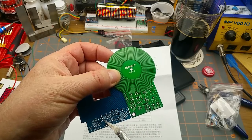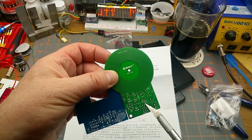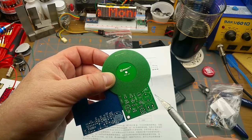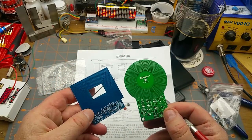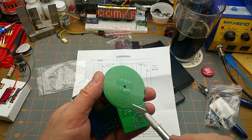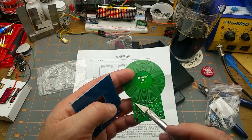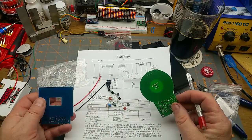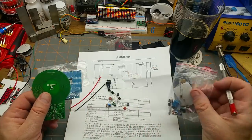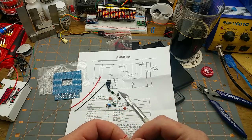On the same listing they also sell another one, and I've already received one of those in a previous mailbag — I'll show you when I go back to the workbench. The green one is a little bit cheaper. Here's the blue one laid out; here's the green one I got previously from a different seller, equally cheap. Looking at the components: three transistors — a 9012, a 9018, and another 9012 on one; and a 9012, a 9015, and a 9018 on the other. They're slightly different but very, very similar, with slight component differences. The coils are wound slightly different but have the same configuration. Both are FR4 boards — the blue one's a little bit thicker. Should I do a dueling kit build one of these days — build them both up and test them to see if either of them work? That could be fun.